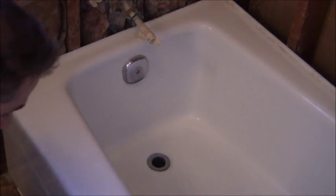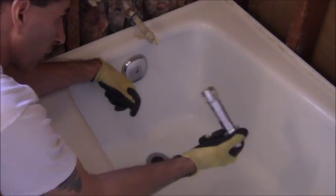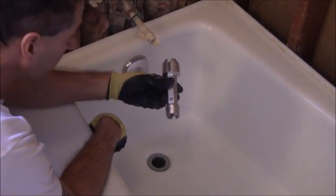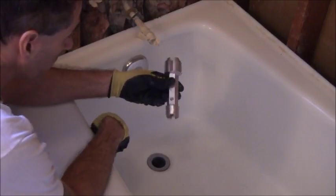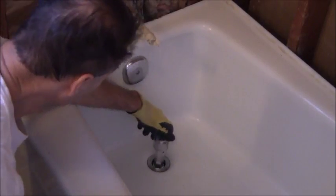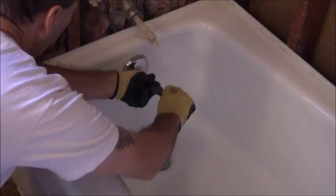Before I go tile shopping, there's two things I want to do to this tub, because I want it to look as new as possible. I want to replace this trim. With this one down here, that would be the more challenging one. I want to use this tool here and just take these teeth, put them in there, and then just use a screwdriver to unscrew it. Let's make sure this one's not frozen.